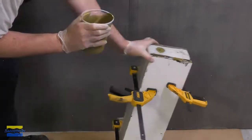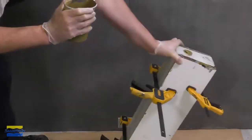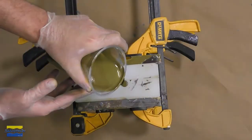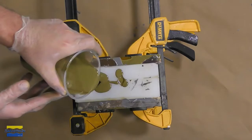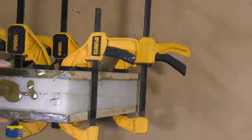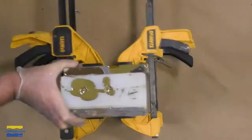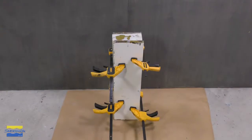The rocking of the mold that you see here basically allows any air bubbles that are trapped in the material to travel upwards. When you're adding powders like the metal filler to any resin, it makes the material thicker and makes it easier to entrap air. By rocking the mold like this, we allow any trapped air bubbles to automatically release and travel upward and out of the mold so they don't end up in the face coat of our casting.